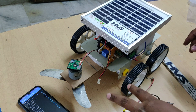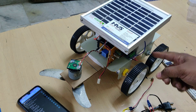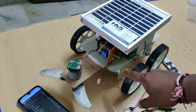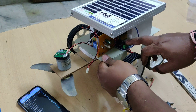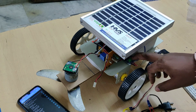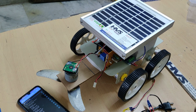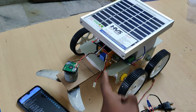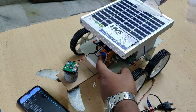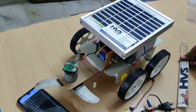When we send the forward command, it is received by the HC05 and passed to the PIC16F72 microcontroller, then to the DC motors through the L293D motor driver. The motor driver takes input from the PIC microcontroller on pins C0 to C3, and B0, B1 are connected to the HC05 Bluetooth module. An electromagnetic relay controls the grass cutting motor.